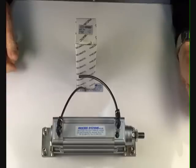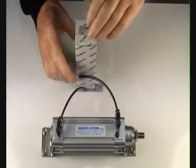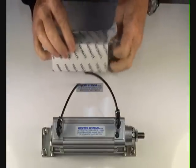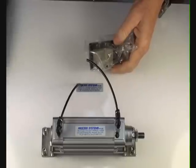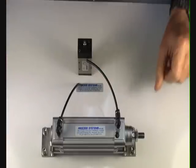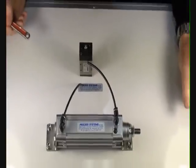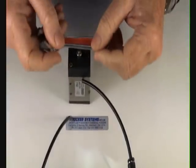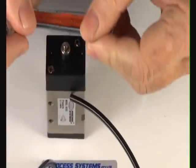A plunger pilot spring return valve, five way pilot spring, designed to operate double acting air rams or another double acting pilot valve. The plunger pilot spring is for areas where you've got a machine slide or a press coming down straight on the top of it.